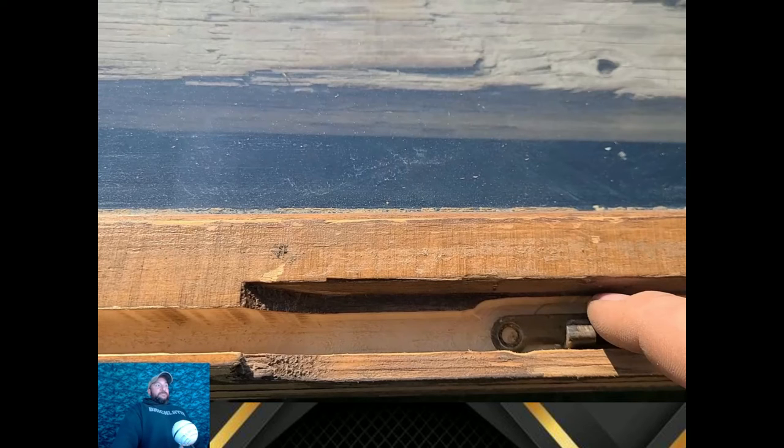If I use the original hardware it would end up poking out of the front of the frame. And now that I'm using shallower screws in softer, more heavily weathered wood, I'm putting a little bit of wood glue on the back of these brackets just to keep them a little sturdier — just for a little added insurance.